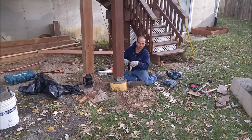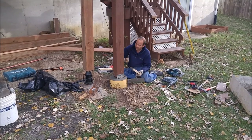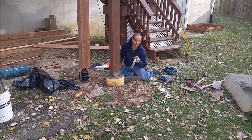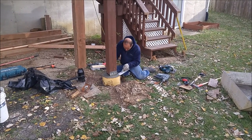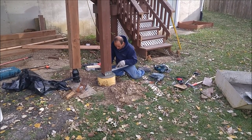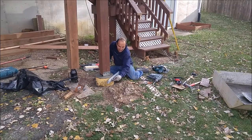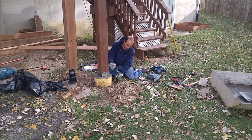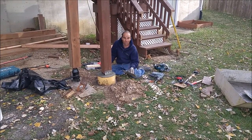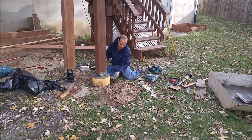What I've done is jab this concrete as we go to make sure there are no air bubbles and it's all settled in nicely up under the post base. I also jacked up the jack about a quarter inch past where we want to be, so that when this dries and we let the jack down it'll end up resting right where we want it. Now I'm just going to take this float and trowel around the edges. We'll trowel this off smoothly and then peel the sonotube off and trowel over the outside edge before it gets totally hard. You can squirt a little water on the exposed area if it looks dry when you peel it off — it'll make it look nice. We'll backfill this dirt to a good height when we're done, and now the post will be well protected from any water on the ground.